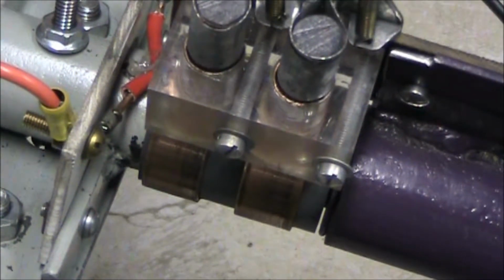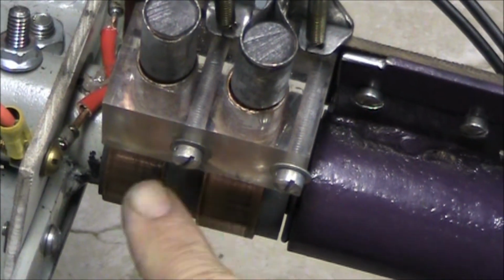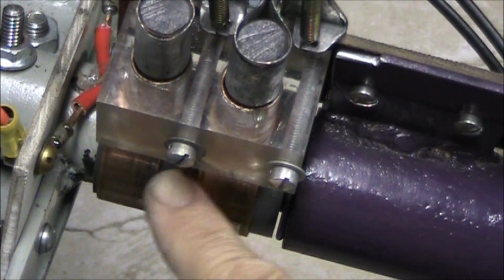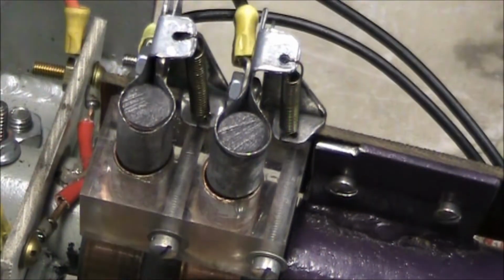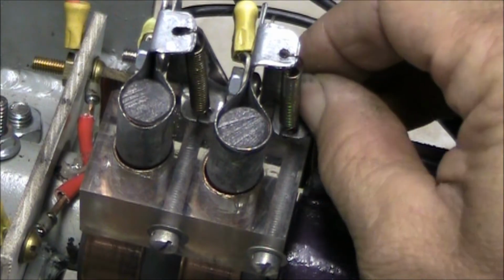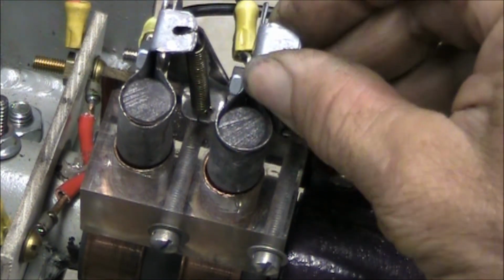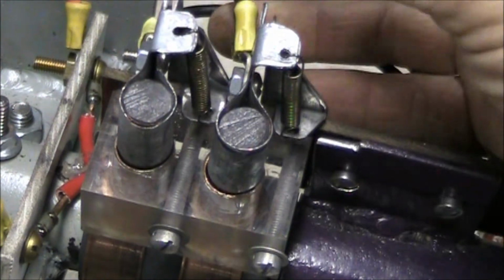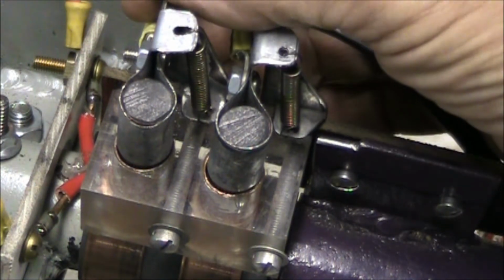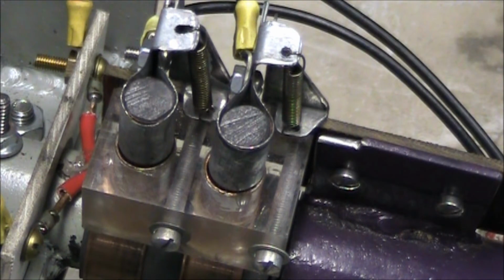Now since I'm going to rotate this, I had to make a slip ring. So I got some copper bands. I cut off a piece of copper pipe and slipped them over some PVC. For the brushes, I'm using carbon electrodes that are used in electric arc gouging, burning and stuff like that. They're 1/2 inch in diameter, and I just pieced this mechanism together.